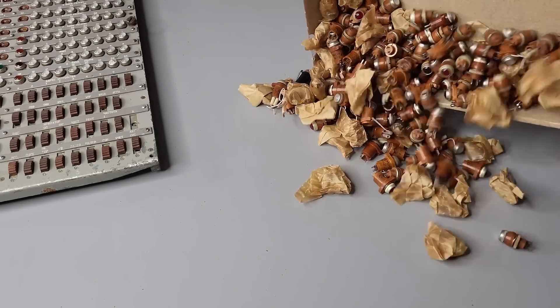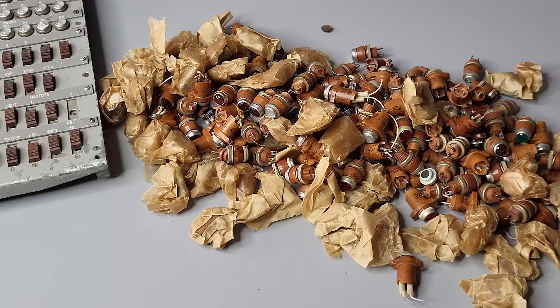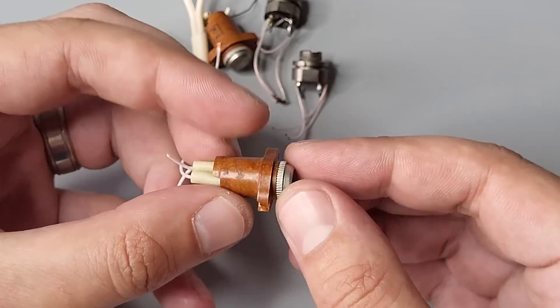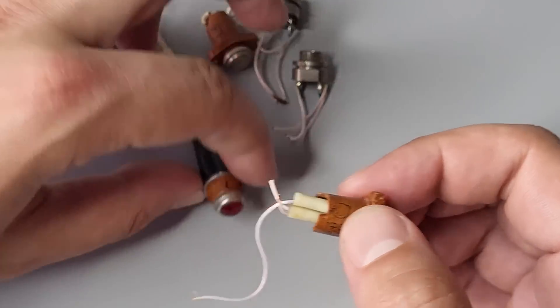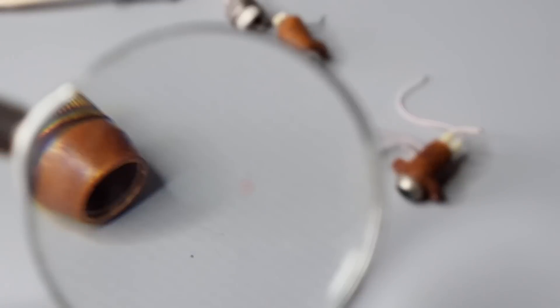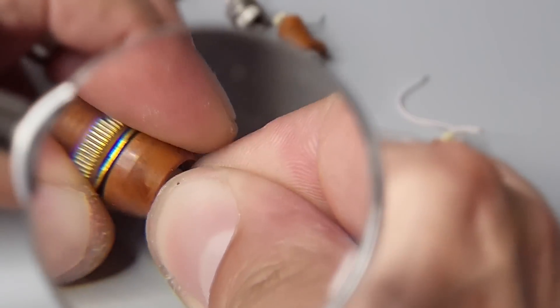Before all, I went shopping for old electronic components, getting a few hundred indicators with matching vents and some replacement switches. Those used in our panel are type MFS1, which have to be secured with two tiny screws. Another type is MFS2, which you mount inside a round opening. All those were designed in the 60s and are based on very tiny bayonet light bulbs.